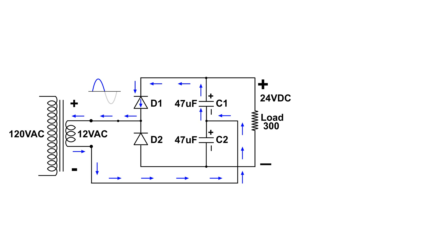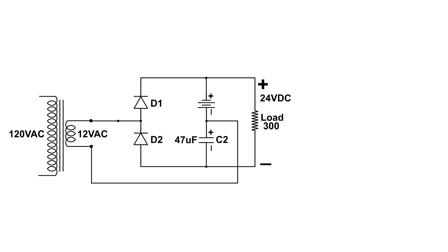When the 12 volt AC has an output in this configuration — positive at the top and negative at the bottom — the electrons flow from the negative side over and then up to the bottom plate of C1. No electrons move between the plates, so the electrons being piled onto the bottom plate push or repel the negative electrons on the upper plate, and they are attracted to the positive potential on the left. These electrons travel through diode D1, always against the arrow, to the positive potential, and this charges capacitor C1.